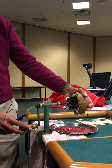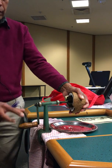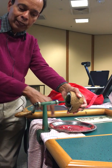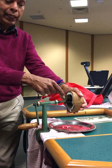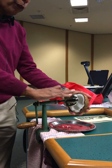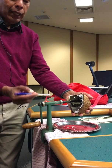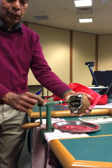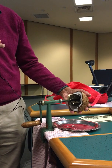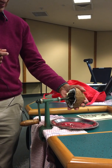Depending on where the coconut is being cut, the induced reaction could be either towards me or away from me while the handle force is towards me. If you take another scenario and press the coconut at the side, if I pull it towards me, you see the coconut is pushing down in the vertical direction. So I have a horizontal force at the handle and a vertical force at the blade. If you look from the top, the bearing reactions are occurring at two locations. Inside there is a shaft with two rows of ball bearings, but the specimen you see in the lab does not have any bearings, and you will see it has already failed.